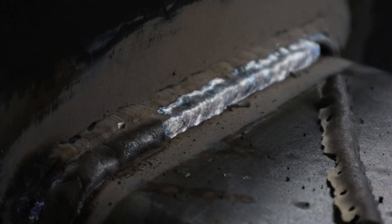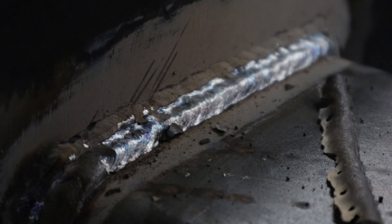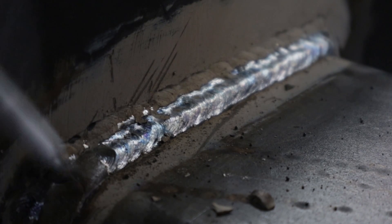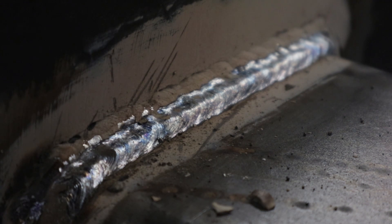Here are some regular shots after the second bead on top — getting about a third of coverage over the first bead. Then this was the third bead where I was doing that manipulation. This is the finished product with the first, second, and third beads all in this shot. That's pretty much the way it went all the way around both columns using the three-pass method.